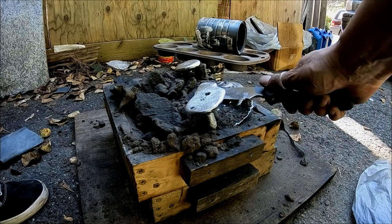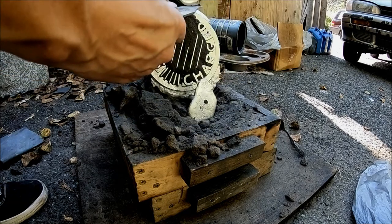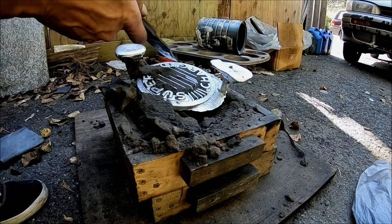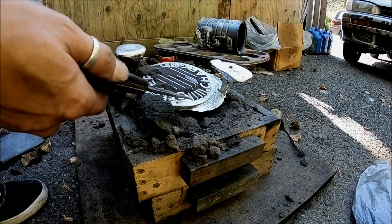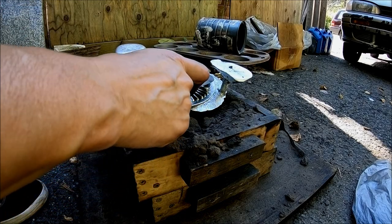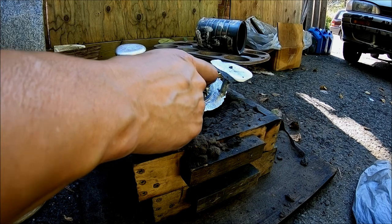Yeah, see, the E's got a defect in it. It's still very, very hot. See that? You can see it. The E, I can mill that out. Then I'll just sandblast it, and it'll still look like the rest of the casting. This is actually really smooth. See how loose sand gets washed in and degrades the quality. There are inclusions here.